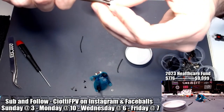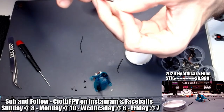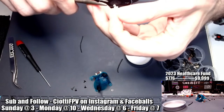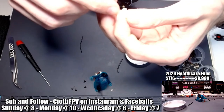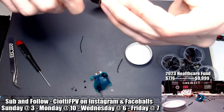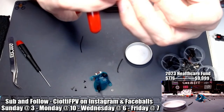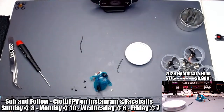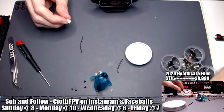What I'm doing with these BT 2.0 leads is spinning them so that the flat spots are outwards. Since it's so tight, this really helps you to have just a little bit of extra space between the positive and negative wires to make sure that they don't jump to each other. And it's cool. That is now looking good. All right. Now for the hard part.